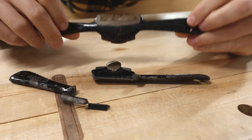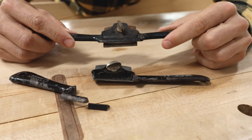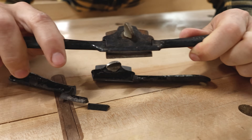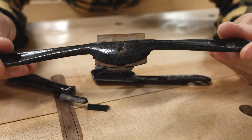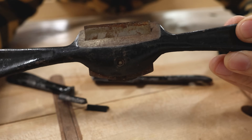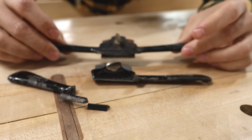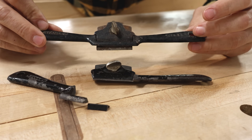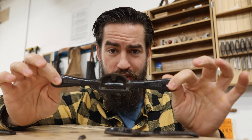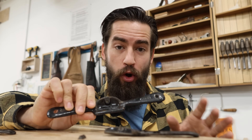I'm very happy with that. This casting, which is the main thing that I need, seems to be in excellent condition. I think I'm going to just buff it out — get a little steel wool, maybe a little wax, maybe a little 3-in-1 — and just clean it up so it looks and feels nice. The bottom has just a little bit of light surface rust, but seems to be in really good condition. So let's dismantle it, see what the interior parts look like, and see how much work it's actually going to take to clean up.